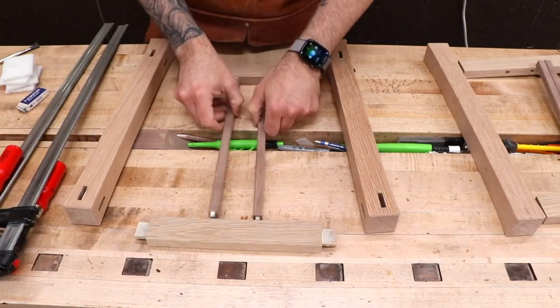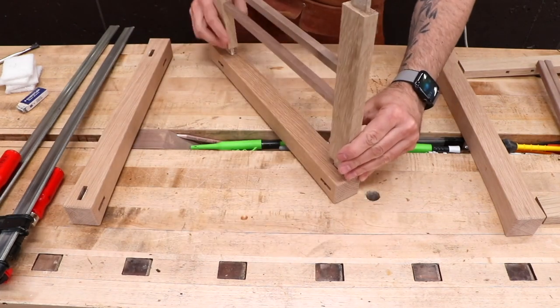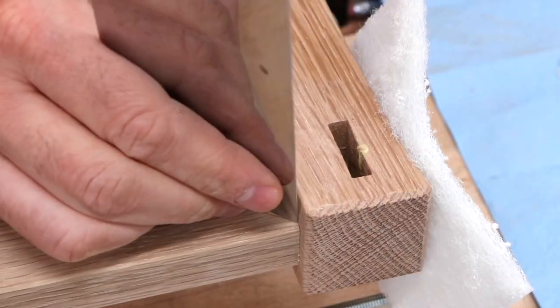So what does all the data from Patrick's video actually tell us? In terms of actionable things, not very much — I don't think anyone is going to change what they do as a result. One thing I'll do a little differently: when describing gluing a mortise and tenon, I used to say don't worry about getting glue on the outside shoulder of the tenon because it's end grain meeting face grain and won't add much strength. In reality, it's not adding much compared to the joint itself, but it's icing on the cake. If that joint is stronger than we thought, why not put a little extra glue? You have a little cleanup to do, but it could make the joint just that much stronger.